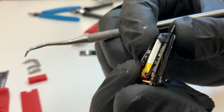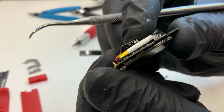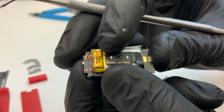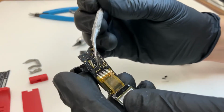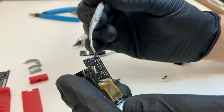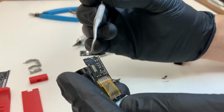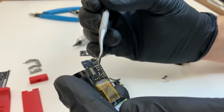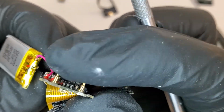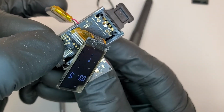What we're seeing here is a board stack. We have a display, we have a PCB, a battery, and a sensor board, where these are both soldered in place. So this is what's called a rigid flex board. We have a rigid component with 2 flex circuits attached to it. Sometimes if these are removable, we'll put a ZIF or a zero insertion force connector here. Pogo pins. Those 2 pins touch down on the USB pads.